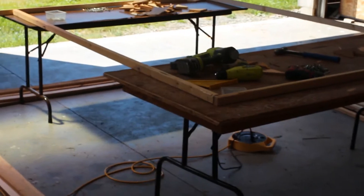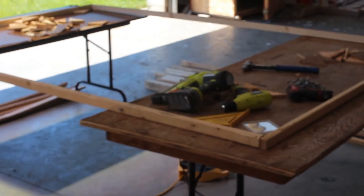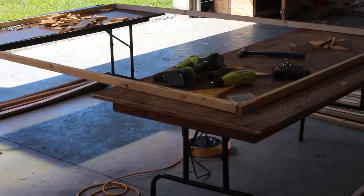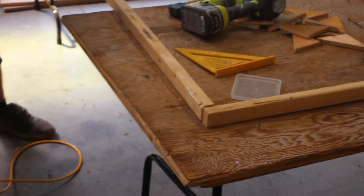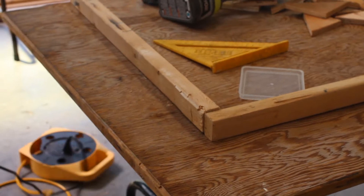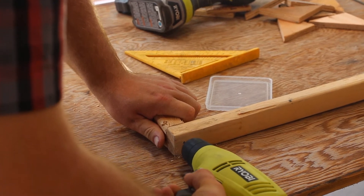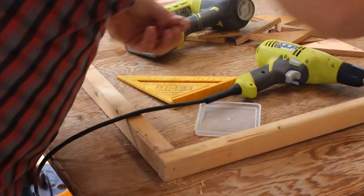What we did is we took two tables and put them a little over 8 feet apart to give ourselves a nice working space. We split our parts into two piles on all sides — the top pieces at one end and the side pieces laid beside the table — which makes it really easy to start moving things around. All we've got to do is throw the boards up on the table, line them up and away we go. Once we have everything laid out and lined up, we tap our corner pieces with a drill bit so we're not going to split the wood, then drop a single screw in there.